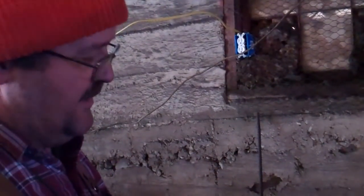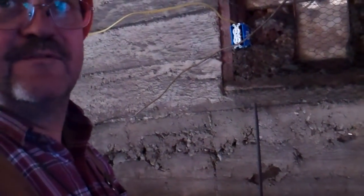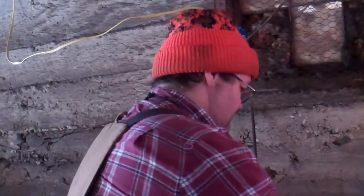Yeah, and watching it to make sure I don't get too much slag plugging up the air hole. What I'll do next is I'll knock a little bit out of the way. And then if it gets to be too much, that's when I tap it and drain it off.